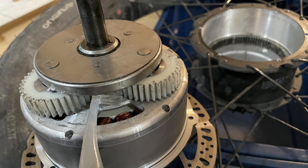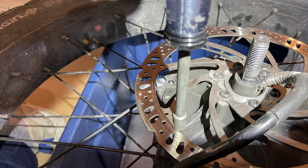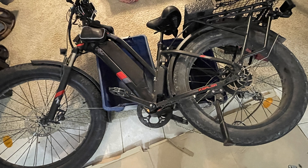I did the same thing with the nylon planetary gears, reaching inside to coat the back sides, and then I replaced the motor in the housing again, holding on to the axle and not the brake disc. Once the planetary gears got down to the metal gears it stopped and I had to wiggle it around just a little bit so it would settle in, but it did that without much trouble.